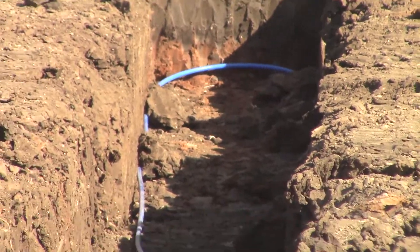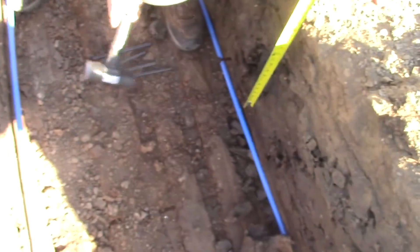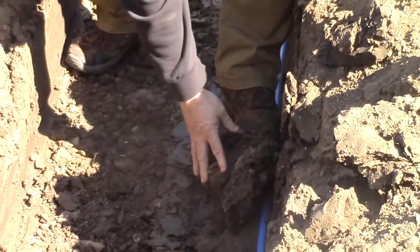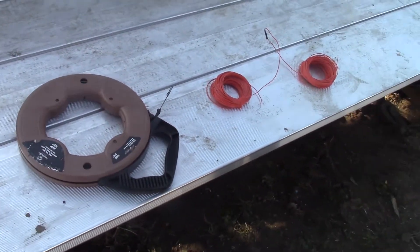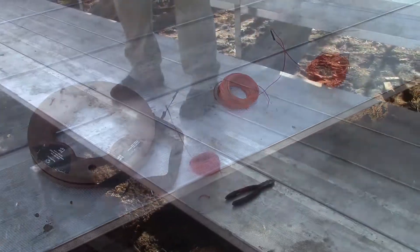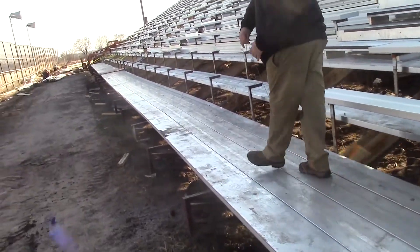We set the pipe in the corners of the trench to make sure they're parallel with each other horizontally and vertically. We lock them down sometimes with landscape spike nails or fill some dirt back into the trench. To get the wire in the pipe, you can vacuum a string line or mule line, but we usually use a metal fish tape. When you fish the wire in, you want to be careful and walk your loop wire out each direction so it does not tangle up before you put it through the pipe.